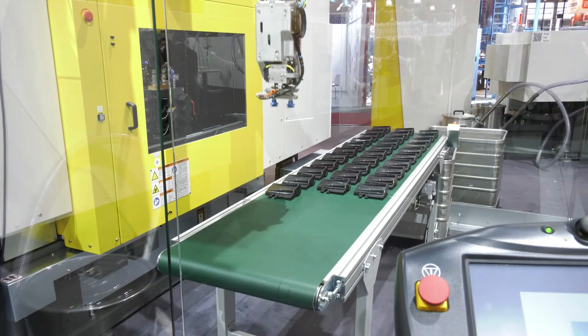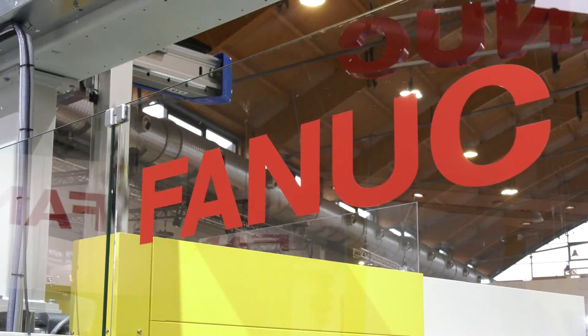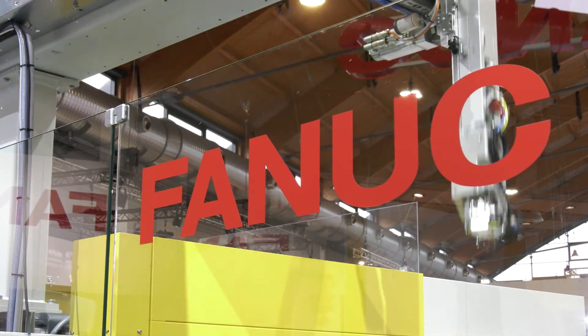In terms of hardware on this machine, you've upgraded a number of things like the screw. We've improved many things — for example, we have more screw and barrel combinations available. In one machine you can choose from six or eight different screws and barrels, depending on the material and the quantity you want to inject. It's quite simple and quick to change — it takes one hour or less.